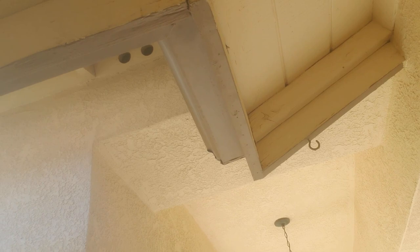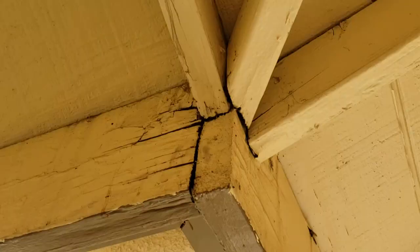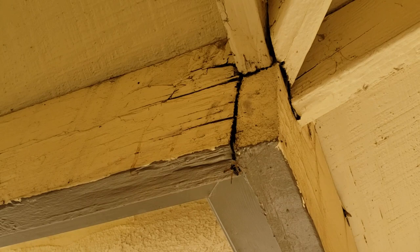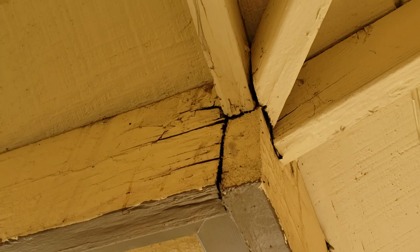Let me turn the camera around. As you can see, not only is water leaking through the back of the fascia board behind the gutters, but it's also leaking inside the garage behind me. The window that I'm leaning against taking this picture has leaking inside the window. So that valley is leaking.